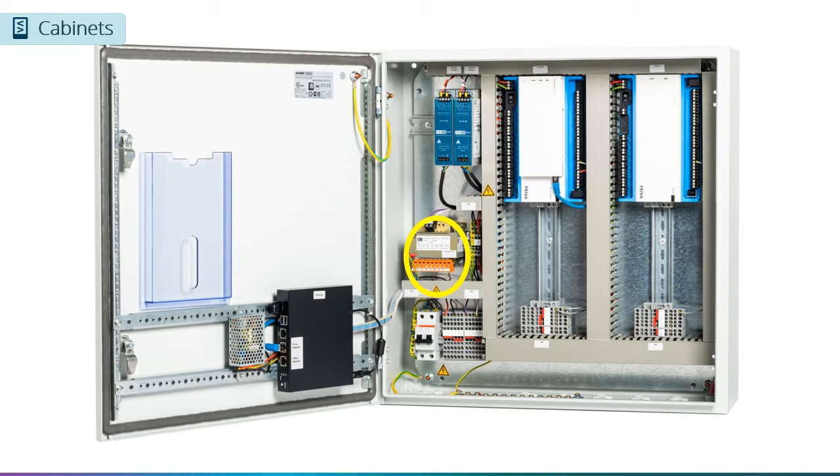In the panel, you'll find an AC transformer which can supply power for your field wiring. It is a multi-tap transformer. When you are installing the compass, make sure you select the proper tap depending on your supply voltage. Since much of your external control wiring is 24 volts AC, you want to be sure that you have the proper voltage feeding it. If it is too high, equipment will burn out, and if it is too low, there will not be enough power to energize the equipment. This transformer is protected by a 4 amp fuse and can deliver 100 VA, typically sufficient for most installations. Should additional power be required, external transformers can be installed outside the panel.